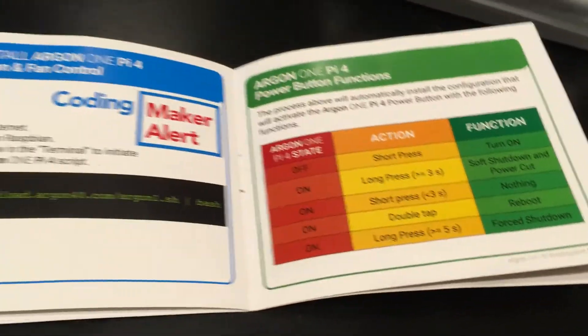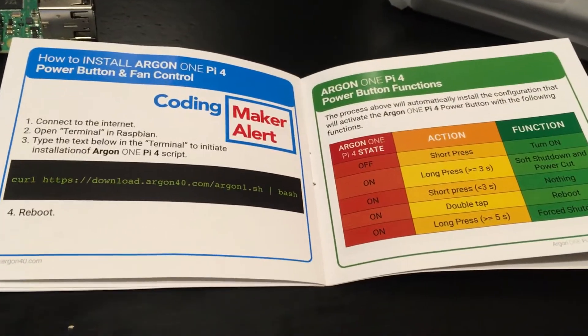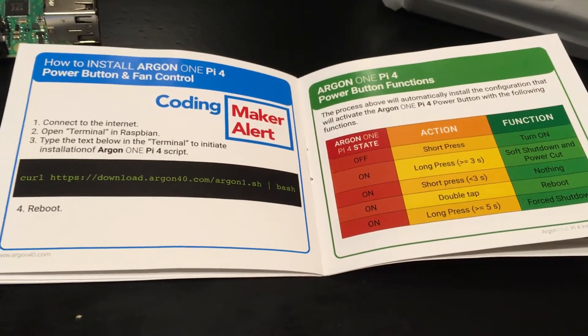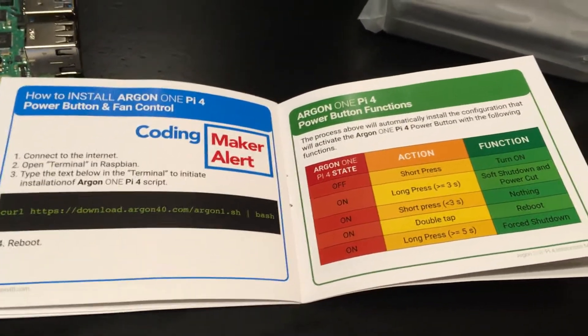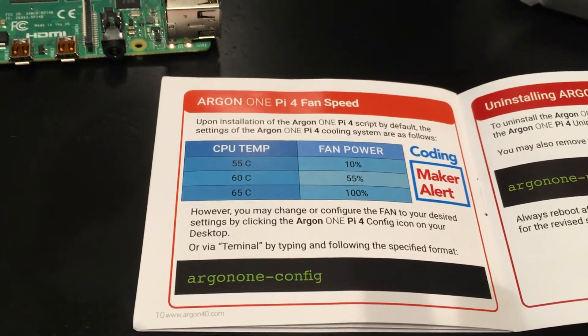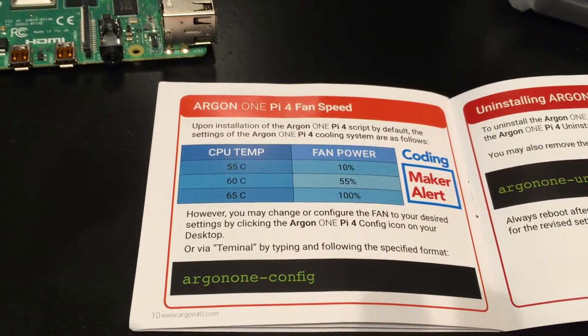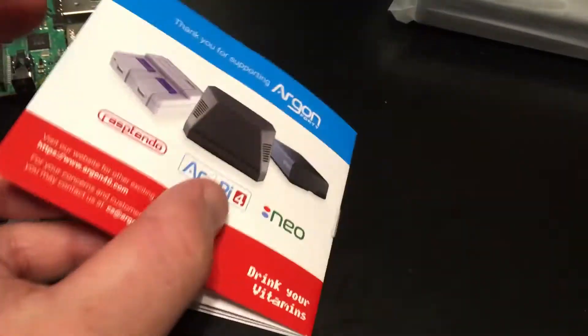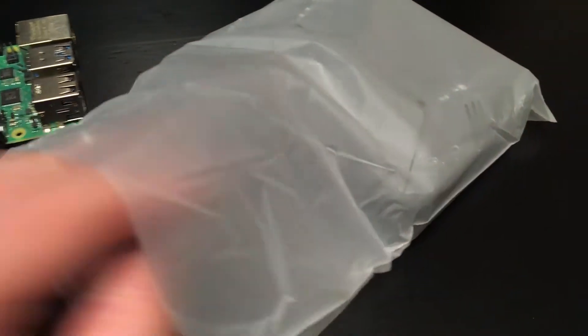Here's all the stuff about the safe shutdown script. And you can also program the fan — you can set it to turn on at certain temperatures and control the fan speed. So you can control how fast you want the fan to spin. If the noise bothers you or you're not doing something intensive you can keep it lower, but if you're trying to overclock you probably want it at 100%.